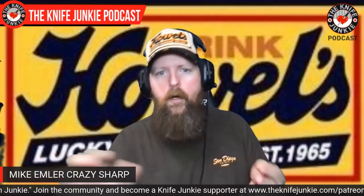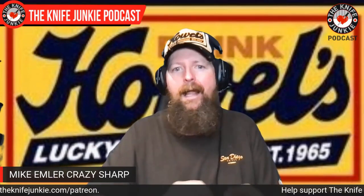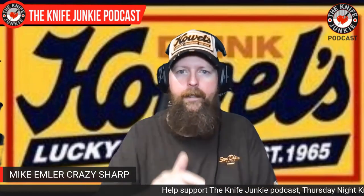A Sanmai is that compromise between the two — an old Japanese style. They did it in swords where they would separate the low carbon steel and the high carbon steel, leaving the low carbon softer steel as the back, and they'd jacket the harder steel in. You get a really hard cutting edge with a softer back, so there's no chance the whole sword shatters. We've turned that into something where you can have a high-speed super steel and clad it in something cheaper. You get the same effect: a great knife with super edge retention, and you don't pay as much because you're not using as much of the high-end expensive steel. Cold Steel used to do it with their Sanmai — as a matter of fact, they tried to patent the word 'Sanmai.' I'm like, that's not gonna work — the Japanese have been doing it since just after Christ was born.